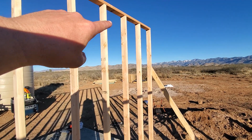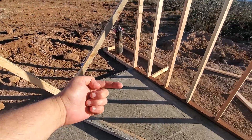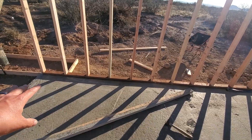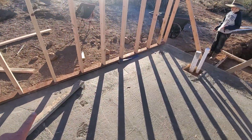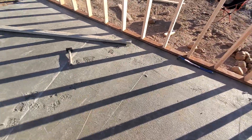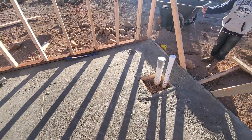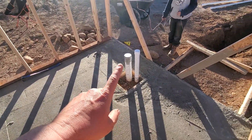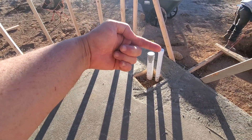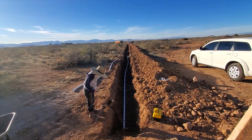The water will come out of the well, up into the top of the tank, out of the top of the wall, and then out of the bottom of the tank back into the building. From there it'll shoot across that side, and over here along the shorter wall is going to be our pressure pump and two pressure pots. This pump house is fairly long, so there's actually enough room for four pressure pots if we add another residence. Here is our electrical conduit, and that is where the water will leave the pressure pots.